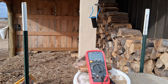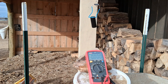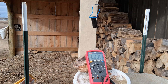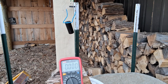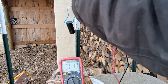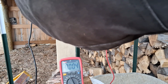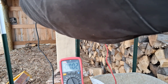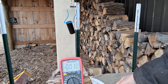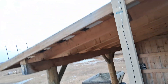So it's nothing magical. It's interesting that there's no ground connected to this at all — the capacitor and bridge rectifier are just floating there without touching anything except the porcelain insulators. I'm back out for another test; it's been a little over an hour now. 1.76 volts DC. Again, no ground — it's just touching the porcelain insulators.